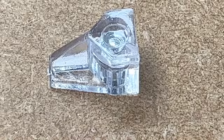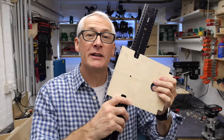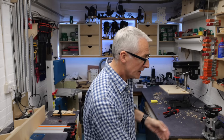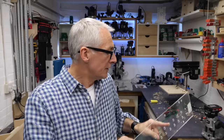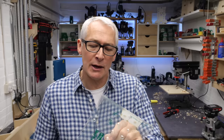So there you go — that's a super simple little DIY router jig designed to make your precision ruler into a shelf pin drilling powerhouse. I used the BenchDogs Precision Ruler for this because I've got it and it's really good, but obviously if you have another ruler or something similar that will do the 32mm spacings then you can adapt the plans to suit. You could use one of these simple acrylic drilling guides — the holes in these are bigger than the 5mm holes in the BenchDogs ruler; mine has a three-eighth or 9.5mm hole, so a simple 3/8 or 9.5mm dowel would replace the 5mm pin.